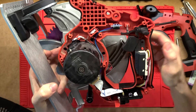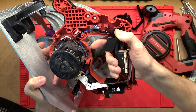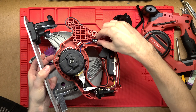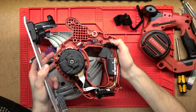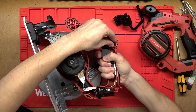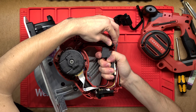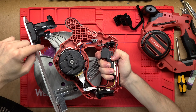This is part of the safety mechanism. When you're holding it, you've got to use your thumb to push this down and then you can actually push the trigger in. So that's just got a little tactile push-button switch just up there. That acts as the electrical safety — it goes back to the main board to signal that it's pressed, so when the main switch gets pressed it can actually work. It is both an electrical and a mechanical lock, so you can't actually press the trigger without this being pulled up. As you pull that up, you can pull the trigger and hear that really nice positive click.